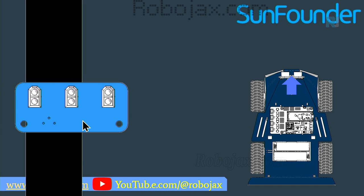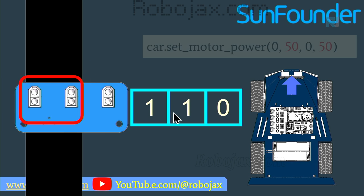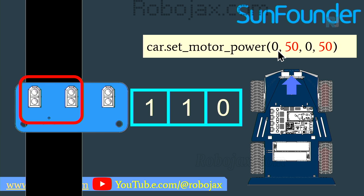Now, if we have two sensors on the left, then in this case, we are reading 1, 1, 0. This 0 is because of this, and these two 1s are because of these two sensors. In this case, we want to bring the car to the left. So these two will be off, and these two on the right are on, and as a result, we will push the car forward with a little angle, not too much, so the car will move back to the line.